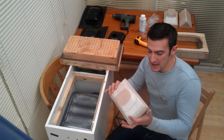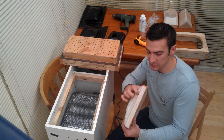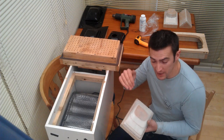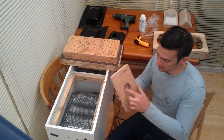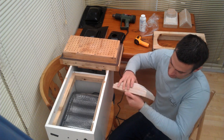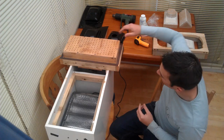The molds I make out of MDF, and it's very important that you create draft and breather gaps for the suction to get to the corners, because otherwise you won't be able to get the definition right into the corners. So anywhere where you want a lot of relief, drill a hole through — this is like a manifold, because it's allowing all of the little breather holes to get some vacuum from the bed itself.